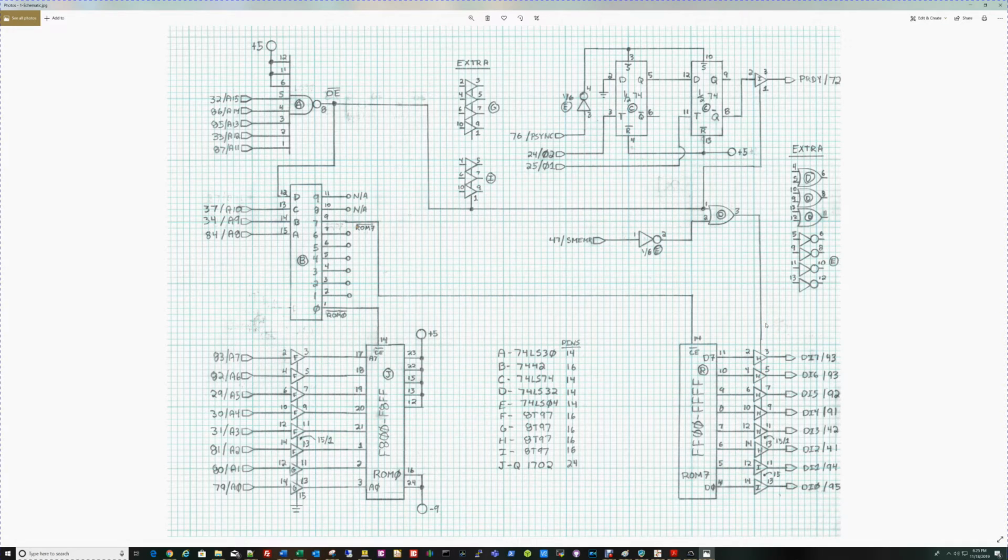So really, that's it. I think I've got a pretty good shot of this working as is. I plucked pieces out of other designs. There's some extra gates involved here: 7 extra buffers, it's just kind of how it worked out, 3 extra OR gates and 4 extra NOT gates or inverters. With these 4 extra inverters, you could go up here and inject an inverter on one of these pins to move the block of memory down 2K. I've just got it hardwired here because this card's designed to be in the upper address space of the machine, from F800 to FFFF. We'll find out once we wire wrap this if the schematic works.